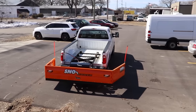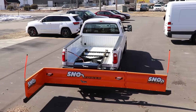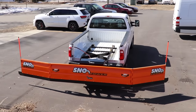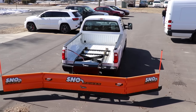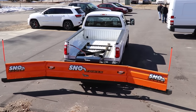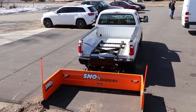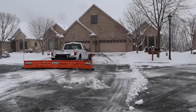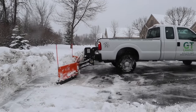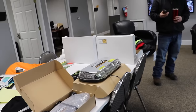Here are some different configurations. This is 16-foot full width. The next one is for forward or reverse windrowing — when you get into heavier or deeper snow and can't carry all of it, you're windrowing it over to the driver's side as you pull forward. Then there's a full box for reverse pushing. We do a lot of reverse pushing with the Snow Power, but we typically go to a 45-degree box because it optimizes it and also allows the wings to give if you hit the snow bank.